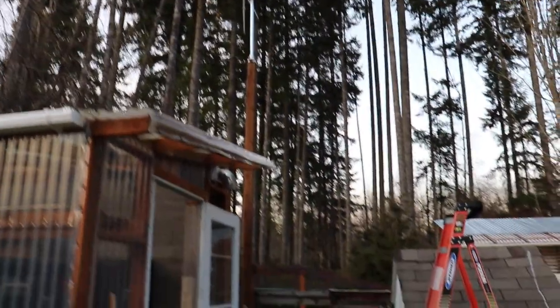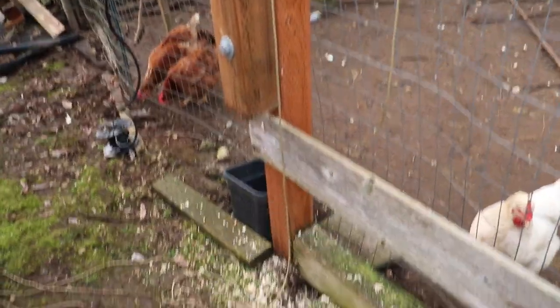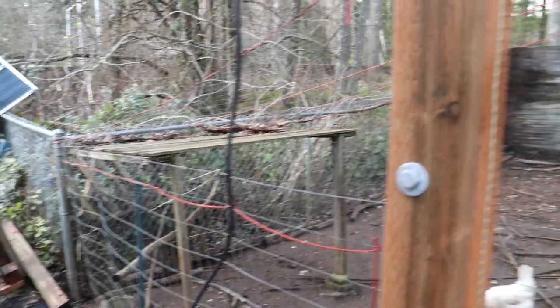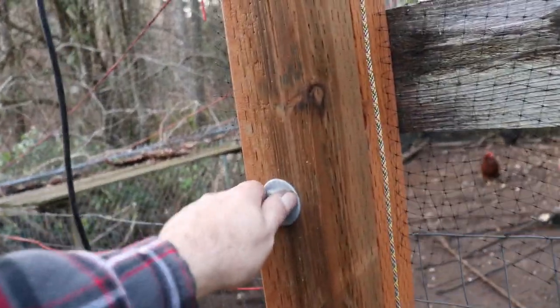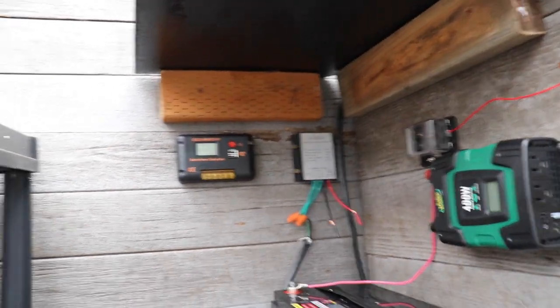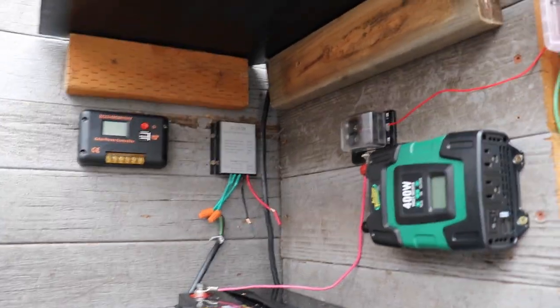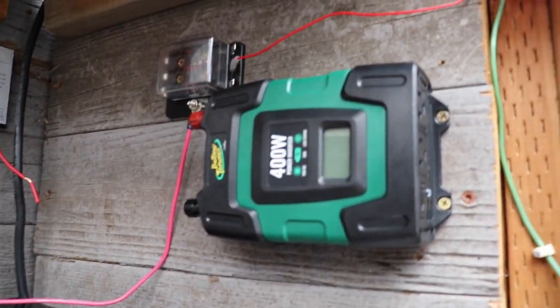Alright, I got it up. I connected it to a 2x4 that I already have in the chicken coop that's buried down. I have a couple carriage bolts — hooked up the bottom carriage bolt, tilted it down, hooked up the windmill, then lifted it back up using the carriage bolt for leverage and got a second carriage bolt in. Because this is a greenhouse there's a lot of condensation that drips down from the roof, so I went ahead and took a piece of really thin plywood and put a couple 2x4s underneath for support — that should keep anything from dripping onto my electrical work. I also put in the Eco-Worthy solar power controller where I want it to go.